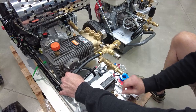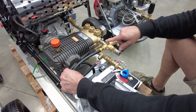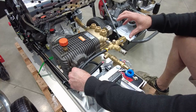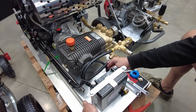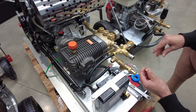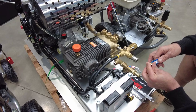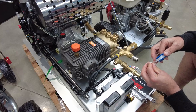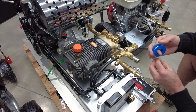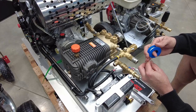All we've done here is removed the runaround circuit. When we take our hand off the trigger, the bypass in this setup — when installed in a trailer — will go back to a water tank. For smaller units, if you're not running a water tank, we can direct this below to discharge on the ground or through the floor if it's in a vehicle or trailer. I'll direct you back to the correct fittings for what you need to buy to carry out this modification. We're doing this mod to relieve the pump and keep the pump temperature nice and cool, so we don't have to run back and turn the machine off. If your phone rings, we won't have to worry about overheating the pump or setting off thermal discharges.